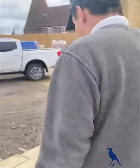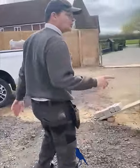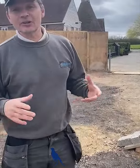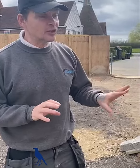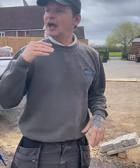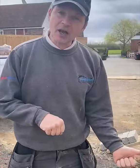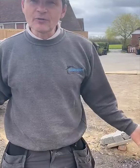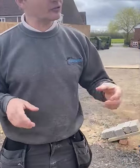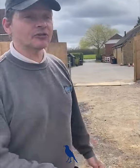We'll just say hello to Matty, who's hard at it. We did say to Matt, should we get another bricklayer in to help him? No — his brickwork is 10 out of 10 and we need to keep the consistency. George makes sure every gauge is the same: he'll fill the bucket up with sand, smooth it off with a board so it's all nice and flat, throw that in the mixer so the whole gauge is always the same. Do not change your cement, do not change the sand or where you get the sand from, because it will change colour. Everyone should be conscious of that.